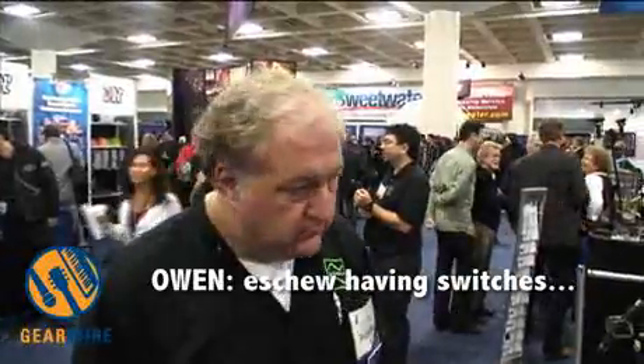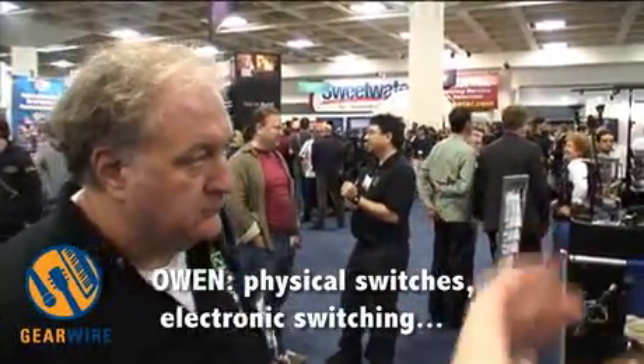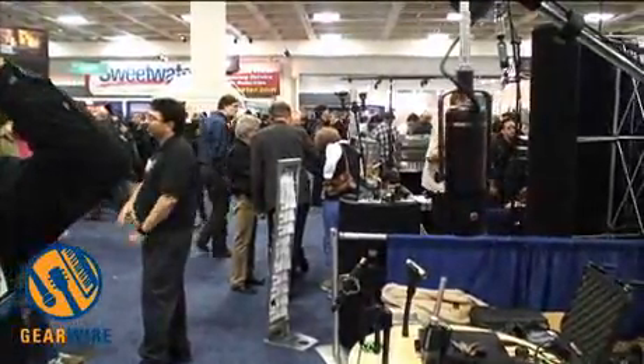Is there a reason for avoiding physical switches or electronic switching in the body? They break — they're hard to make well. The Series 7, the 700, is not a new design; we've been making those since 1992, 1993, and we made one with switches and it works fine. But we have these separate signals already in the microphone. Recording them separately and making that choice in mix down makes a whole lot of sense to us. Suppose you want to change the pattern in mix down — it sounds too close, let's make it a wide cardioid. If the session's finished, you can't do that. You can do it in mix down if you have the W and the X channels.